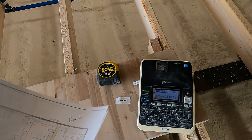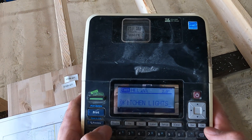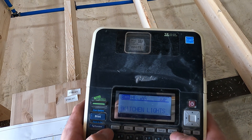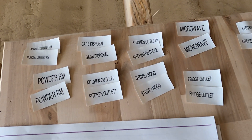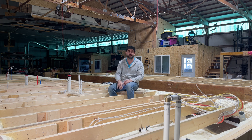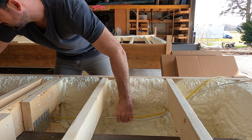When it comes to the electric, we want to make sure that we're using a decent labeling system. I use laser labels — I love them because they stick really well and are easily legible. I would strongly recommend them. For about $80 it'll save you so many headaches, because there are so many times where you'll write with a marker on the side of the Romex cable and over the course of the job it gets faded or rubbed off. But those labels are waterproof — they'll stand up to pretty much anything, they don't fall off, and they'll stand the test of time.